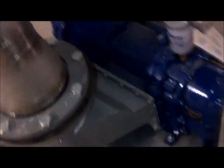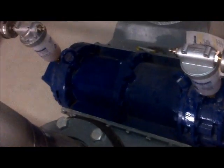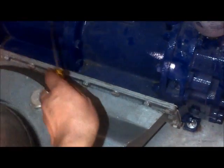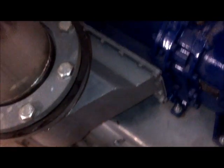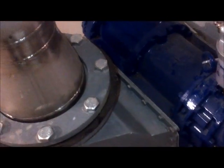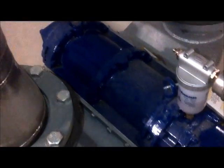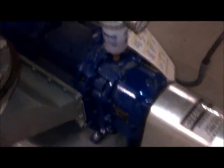What you have here is four lobes as opposed to two, because it's a high-pressure application. You could have one-lobe or two-lobe sets — actually, by the look of it, that would be an eight-lobe system. So this is a real high-pressure pump. We'll go down and see what we can get for flow on this one.